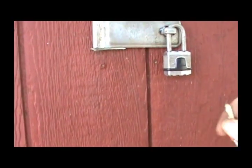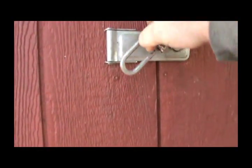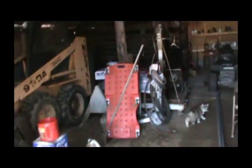This is just a 30-amp service coming out here. The only thing that pulls any amps is this air compressor — it's 220, which I didn't think I had run, but I did. I've got three circuits out here right now: one for lights, a second for two outlets, and a dedicated 30-amp outlet for the compressor because it trips 20-amp breakers on startup. That took up all my room.